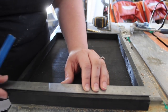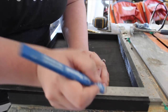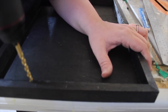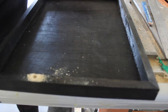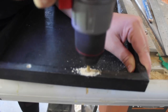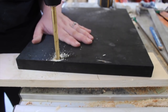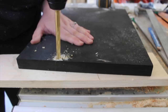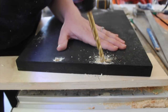My plan for this was to make it into a tray, and in order to do that I needed to add some handles. I used a ruler, found the center of my tray, and then measured two inches off that center on either side. Next I drilled a hole right through the edge of the frame where my rope handles will go through — drill a hole on either side at each of the marks that you made. When drilling from the other side I used a much bigger drill bit — the biggest one that could fit into the ledge of my frame — and I twisted the drill bit back and forth a little bit to widen the hole.